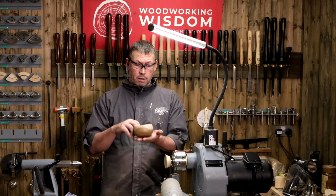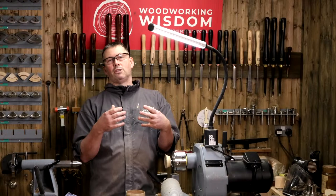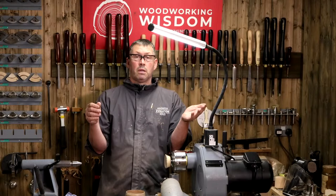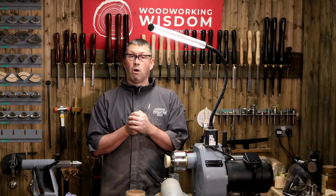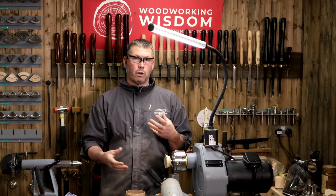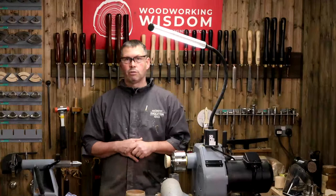The other thing that we haven't discussed, I have discussed in previous videos, is rough turning. Like I said, if you want a rough turn, do the same thing that we've done today, but instead of turning it thin, turn it thick. If you're turning a big bowl, leave it up to an inch and a quarter. A smaller bowl is down to an inch, just under. Let them dry. They'll be dry within six months to a year. Return them then at that point, when they're dry, and you've got a finished bowl in record time. You'll find a lot of turners do that to get cheaper timber and to speed up the bowl drying process or timber drying process.